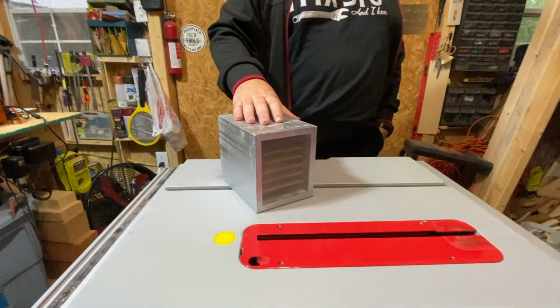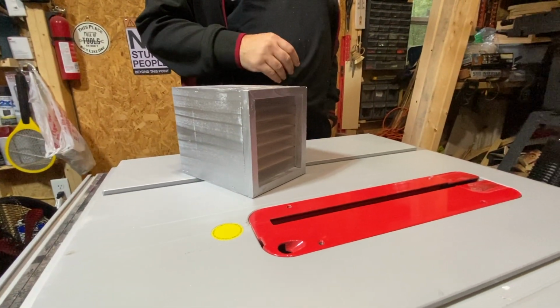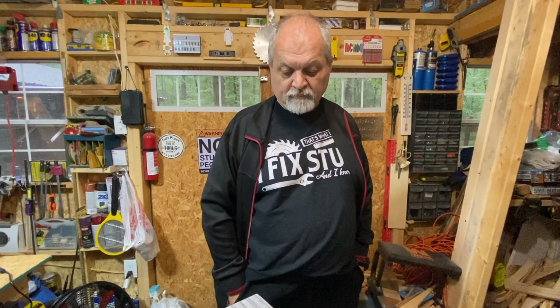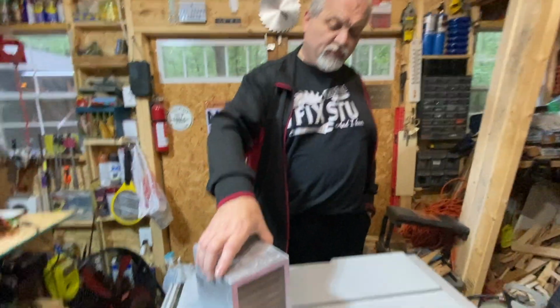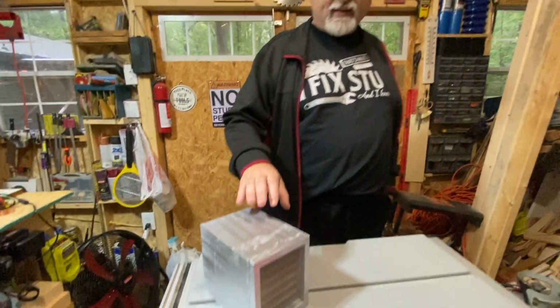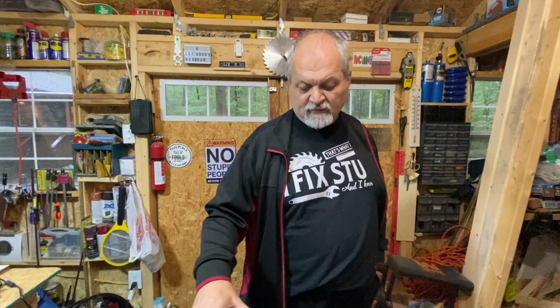And how about painting? The blasphemy of painting nice wood. I had a hard time with that, I must admit. It depends on your application and where you want to put it and how it will fit in with your overall design and scheme of things. Yeah, I think it was the right choice for this, but still it's kind of painful to paint the nice wood. One of the things that we could have done a little better is to seal the wood before we paint it, so it will be even smoother than it is. It's not bad, but you still can see the grain.